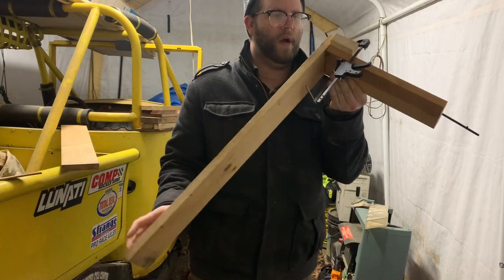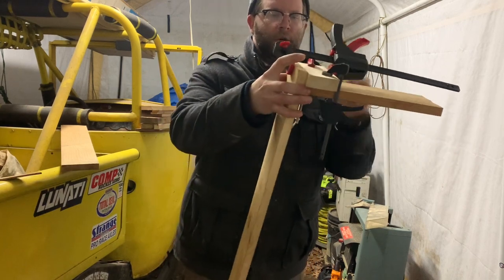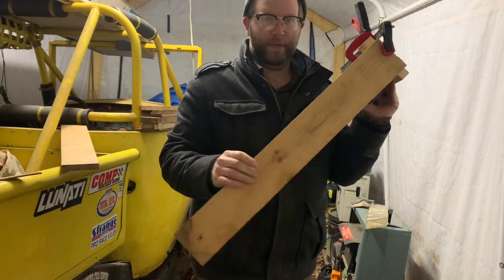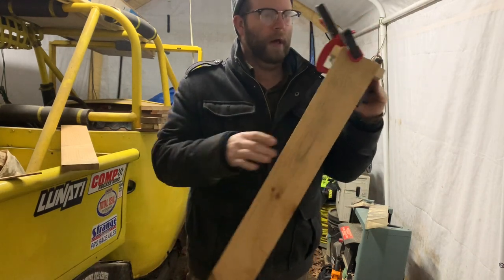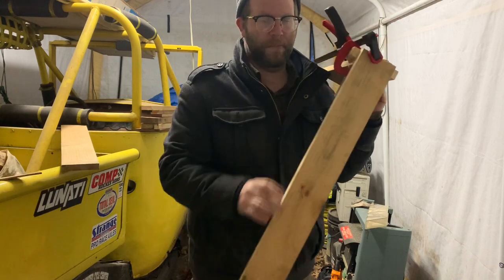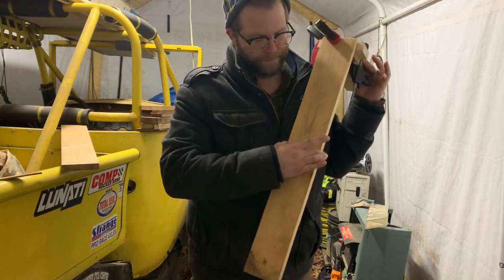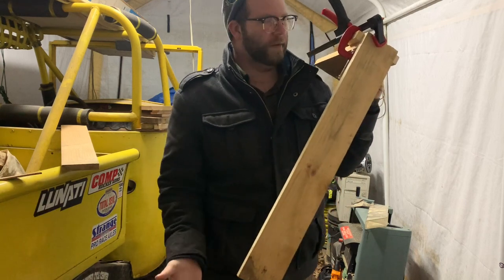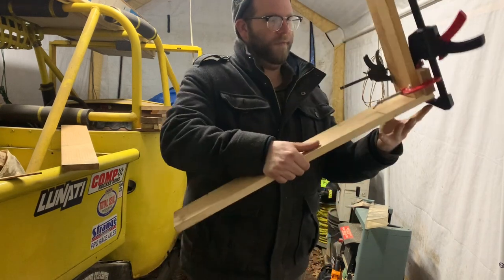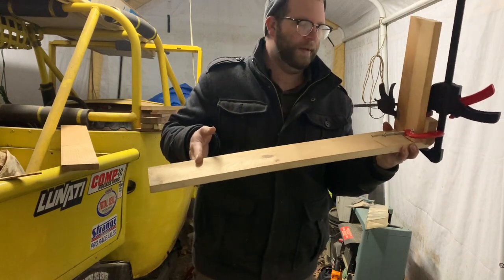So this is your standard wooden ammo box joint, corner joint. What we're going to be working on first are the side panels of this crate. They're 26 long. This is just 1x4, so it's a little over 3/4 thick. I'm making mine 28 long, originally they're 26, so I can fit 1, 2, 3 rows of DVDs in it.